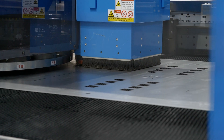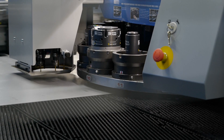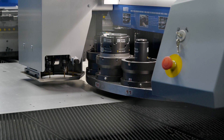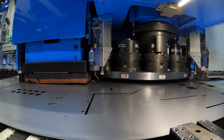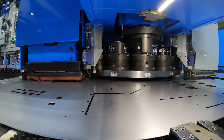This machine is now able to do all of the things we love about a punching machine: all the punching, the forming, the tapping work. On top of that, for any complex geometries that require something more than punching, there's a laser head on there. So we can equip this machine with laser cutting for doing large radii arcs and other complex geometries.